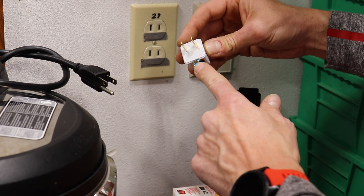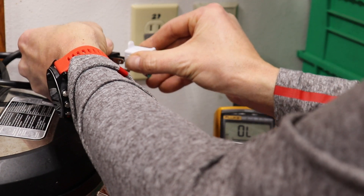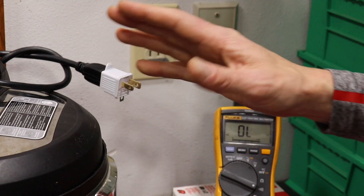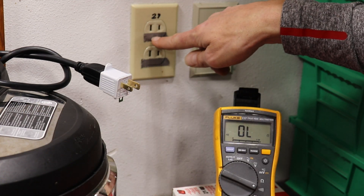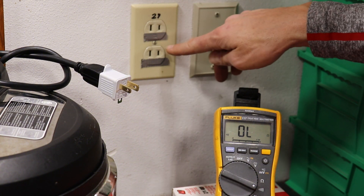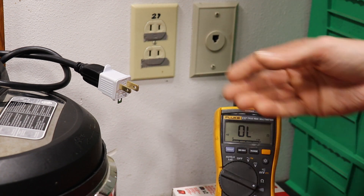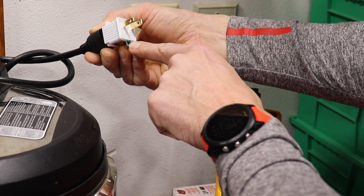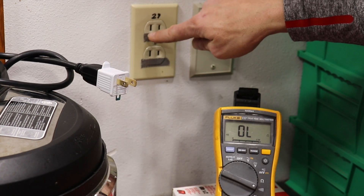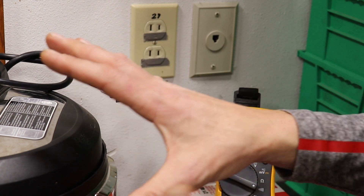However, I don't think I've ever seen anybody actually use this properly. If I place this on and stick it into the outlet, is my instant pot going to work? Absolutely. Am I losing my grounding protection? Absolutely. There are other ways to protect ourselves, such as using a ground fault circuit interrupter outlet or breaker. But just know that if you use this device and you don't connect that screw — and there isn't bonding between that screw and the neutral — you are losing that grounding protection.